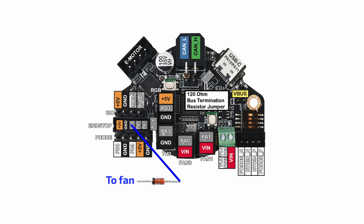Quick edit here — I forgot to mention you should install a diode in the tachometer line to make sure that you don't get back voltage through that line. What can happen is the fan will ground itself through the tach line, which means you'll lose the ability to turn the fan on and off, and more importantly, this could damage your main board. What you need to do is get a diode — I just use the standard BAT85 diode that we use on probes — and install it in the tach line between the fan and your controller board, with the black stripe of the diode toward the fan. This will stop backflow voltage and you won't have any problems with blowing up your motherboard.